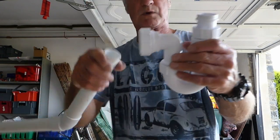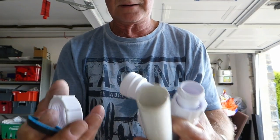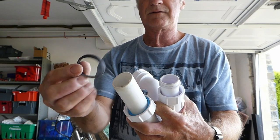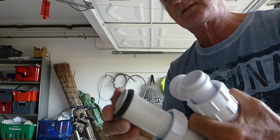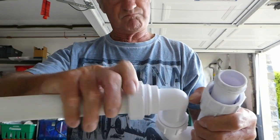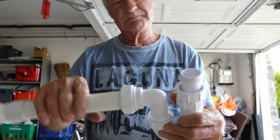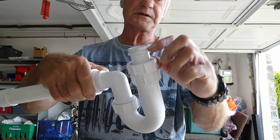To make it easier, I've got a bit of waste pipe here — this is an inch-and-a-quarter basin waste. Basically the nut goes on the end like that, followed by the little ring, followed by this little concave piece — make sure that is round the right way, it goes facing out. Once they're on, you literally just push them together and do the ring up. These are only meant to be hand tight, though quite often they've been done up with grips. It should hold water just hand tight.